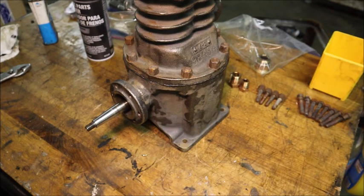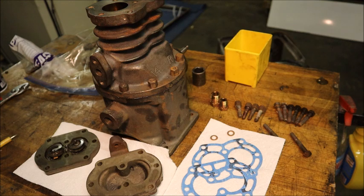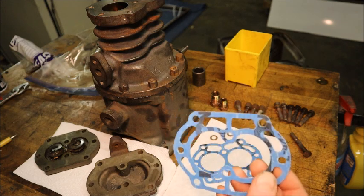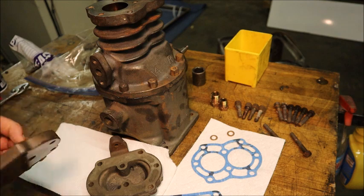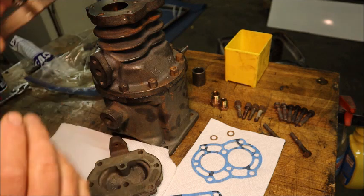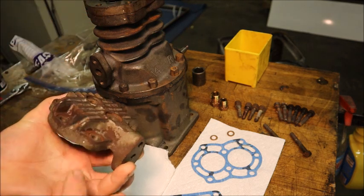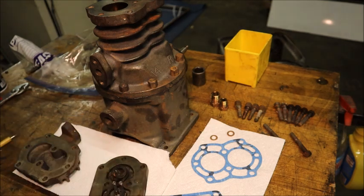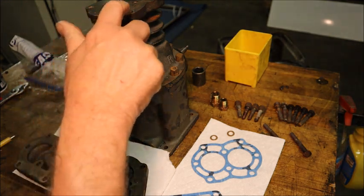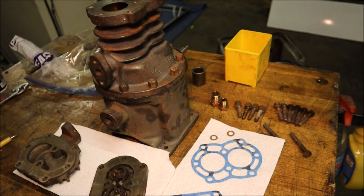Going to put this away and once I get back in town go ahead and finish the reassembly — going to continue going back together with this Frigidaire compressor. The sealant has cured — had a few days to cure. Got some new gaskets here and new copper washers for the head bolts, the two that take copper washers. Put some witness marks on there showing position. Now, when you're dealing with parts this old, even though this type of gasket really shouldn't need sealant, I'm going to put the tiniest amount around just the outside edge to help prevent external leaks — the belt and suspenders approach is a good idea.